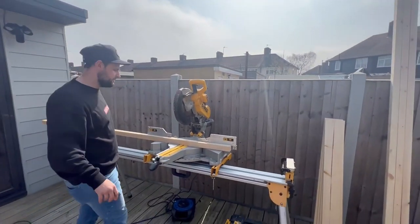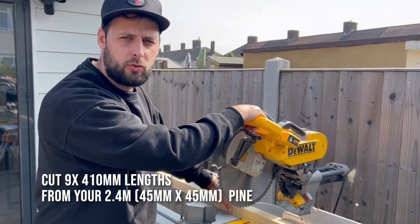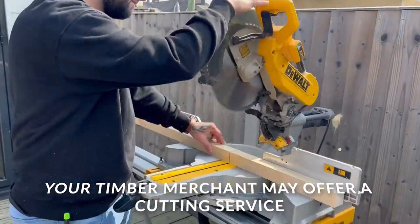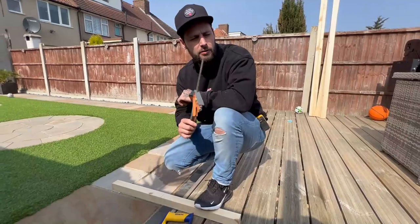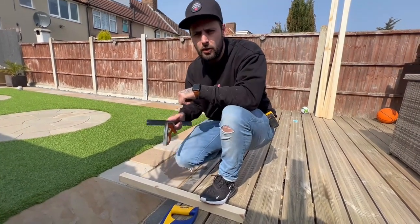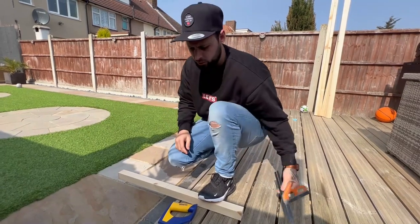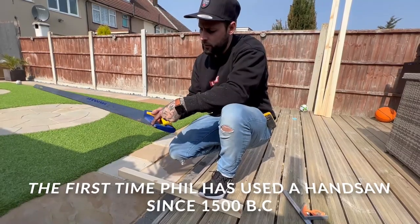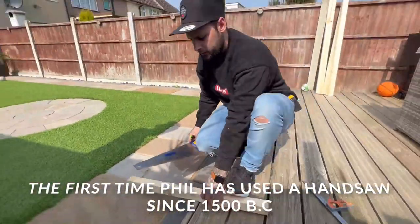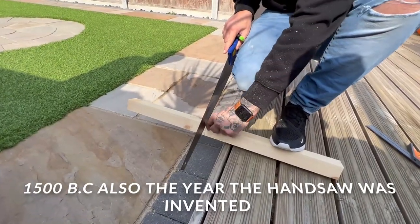First I'm going to cut all the 410 millimetre legs. If you haven't got a power saw like this you can use any saw - a hand saw will do. We'll do one with a hand saw just because we can. For anyone who hasn't got power tools, use a wood saw. What you want to do is mark round the wood so it's easier to follow with your saw, because if you're not very confident you can veer off and get wonky cuts. Use a square - all saws have got a 90 degree and a 45 degree. Bang that across, make your line, turn it, make a second line - that's enough, so you can keep your saw on the right plane.